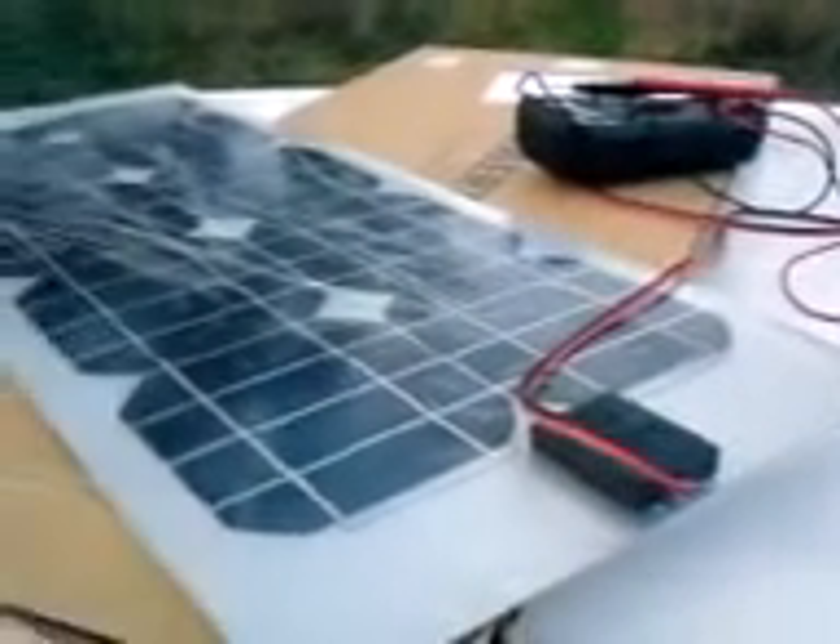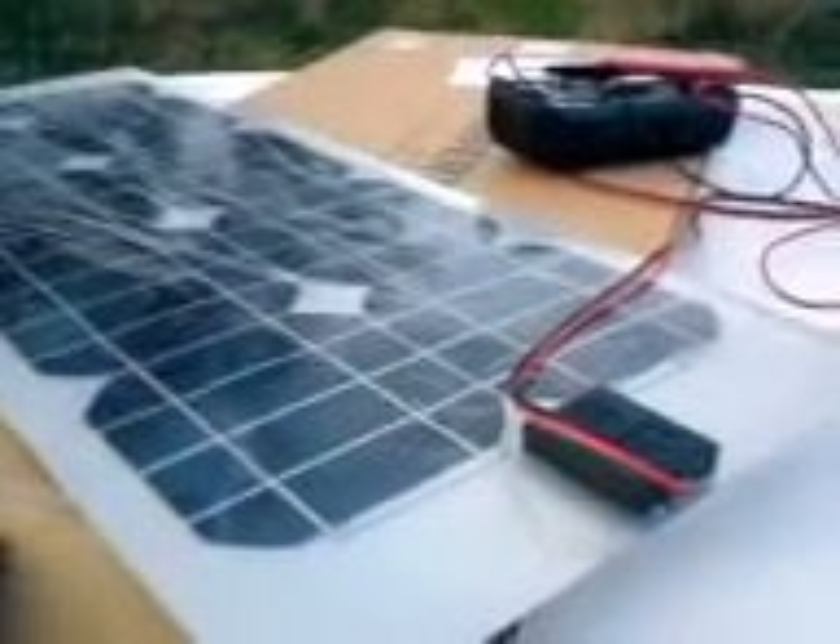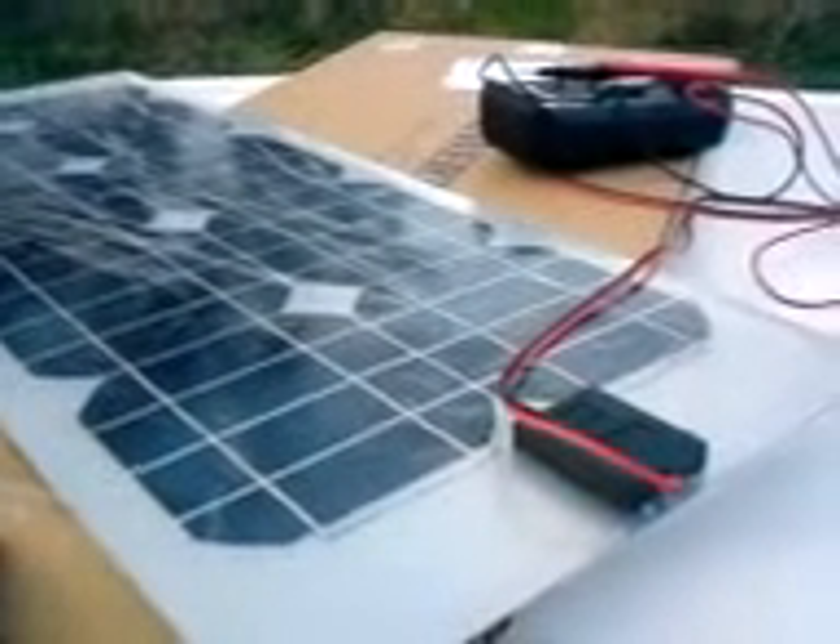I'm only sort of getting - the sun turned to absolute baloney. I'm supposed to get 1.24 amps short circuit, but the clouds are over and all this and I'm getting like 0.5, 0.6. It's not that great. But I'll see how it is tomorrow morning - I think it's probably going to do what it's rated at, considering the sun's going down and the clouds are over.